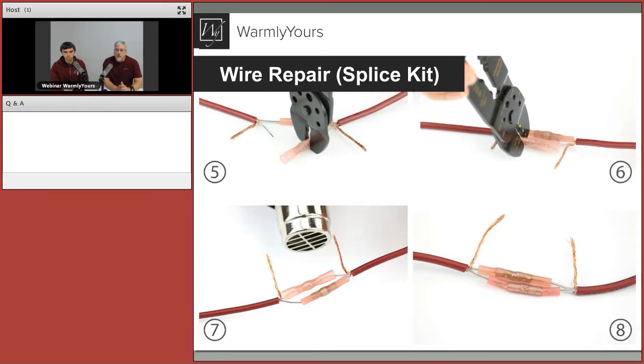Notice how the clear wire still has insulation left between the pink and merlot-colored sections — that's insulation. The reason those aren't bare wires is that if they were bare, as soon as they touched each other you'd have another short. That's why it's important to only take a small amount off each of those clear wires — because then the heat shrink goes over the insulation of the particular core wire too. Very important to follow the instructions, which do come in the kit.